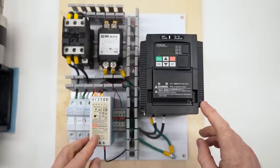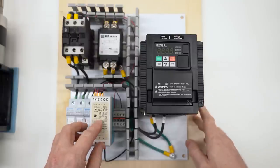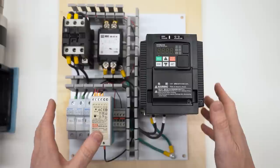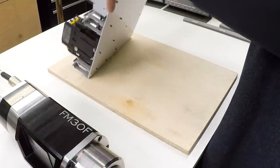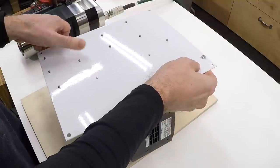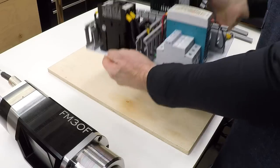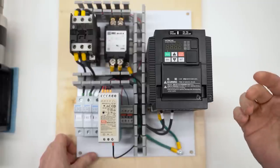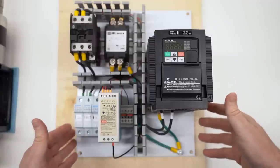When I've set up previous VFDs — like the one on the lathe or the electronic lead screw box — I used CHKO series Hammond boxes without a backing panel, screwing components directly to the back of the enclosure. This time I'm using a different kind of box that has a sub-panel: a separate sheet metal panel that you mount all components on, so screws go through the panel rather than the back of the box. The panel then mounts on standoffs inside the enclosure. This means the box can mount flush to a surface, and you can work on the electronics out in the open rather than buried inside the box.